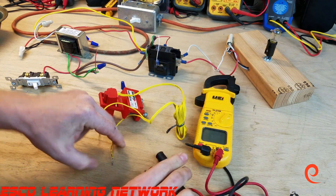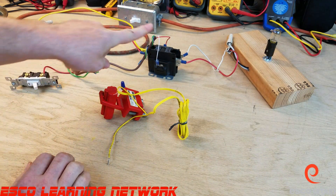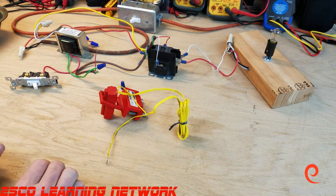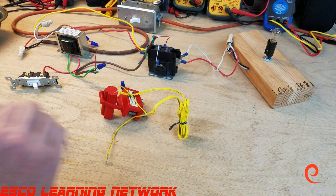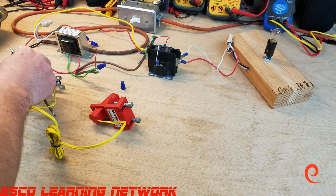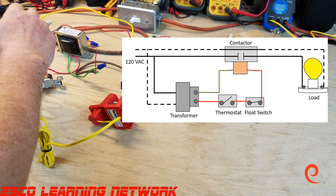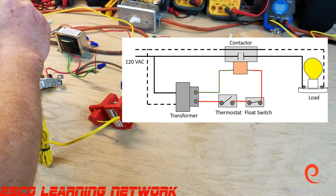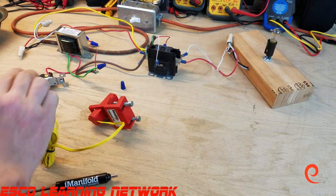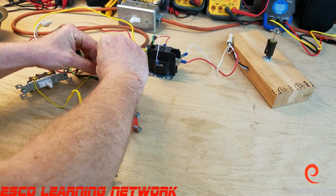I have a little lab exercise set up. I have a contactor and a little light over here that's going to serve as our air conditioner, heat pump, whatever. We're going to wire up — I'll show you the schematic — what I'm wiring up. We're going to put this in series. The switch I'm wiring here is going to be our thermostat, and this float switch will be in series with our contactor, which turns on our heat pump or air conditioner.